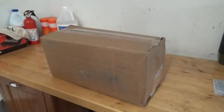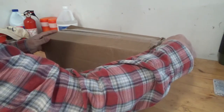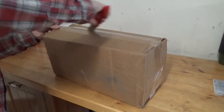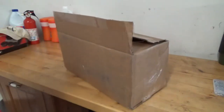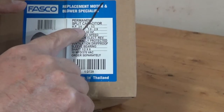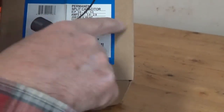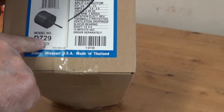Definitely a lot of noise. Okay, motor's here — let's see what we have. The box is a little beat up, not a problem. The absolute main thing for me is the voltage: 208, that's what I need. Horsepower — I'm going to be using a half, going in the middle. Amps — 3.8, I think that's on the other one too. Shaft is one half by six, that's normal. Let's open it up.